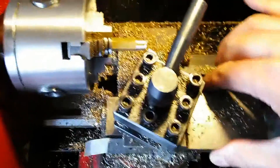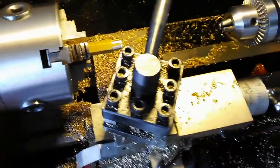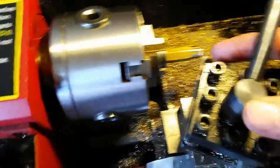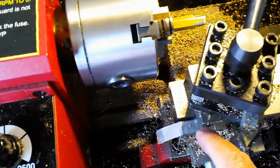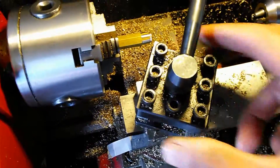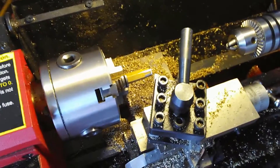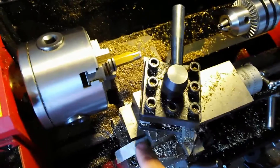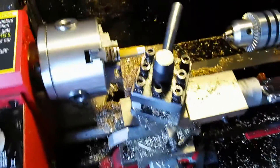This axis is actually moving a little bit side to side - you can kind of see it. You want that movement out of there. If it's that obvious, the movement is pretty bad. What's happening is when this is cutting, it's causing a downward force and moving the carriage. So I'm going to shim it a little bit more, maybe on the other side to get both rails done - that should stabilize the cutting. Sometimes problems on lathes are not the most obvious things; sometimes it's just a subtle thing like this. This shim has gotten a little looser over time.